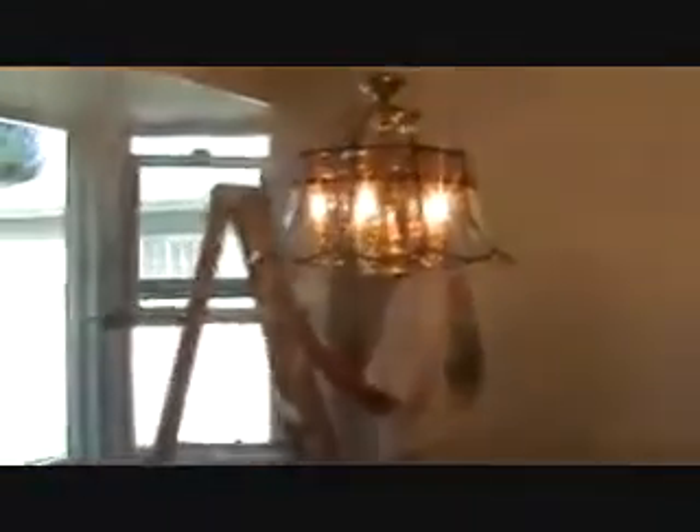The closer you get with the roller, you have less area you have to brush. You did that pretty easily, but for a first timer whose hand isn't as steady, I don't know if they should get up that close. You've got to be mindful of how close you are. Usually with a 9-inch roller, you have more control to get as close as possible to the ceiling line.